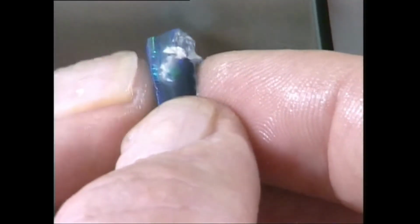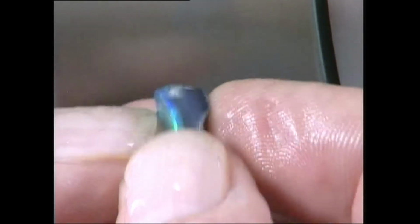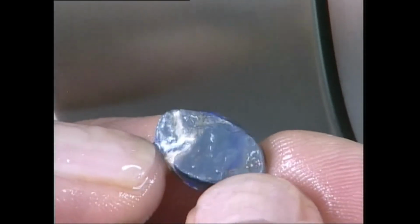Again here we start with a high point on the back, working at the angle that we want the back to finish at. Take away the highest points, and as you get to sand areas like this, you jump over it. Nothing really there to cut. We basically bring the edge of the stone up bit by bit until we have a fair amount of balance in it.